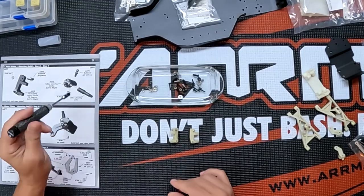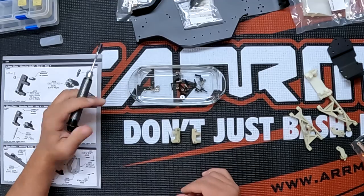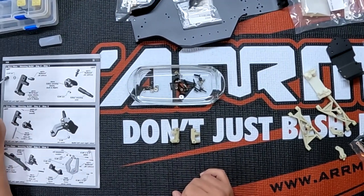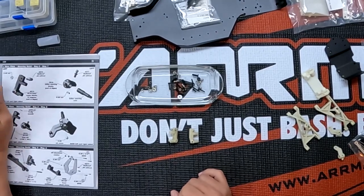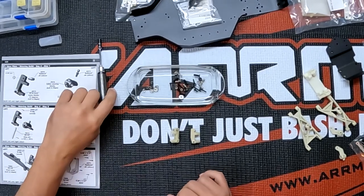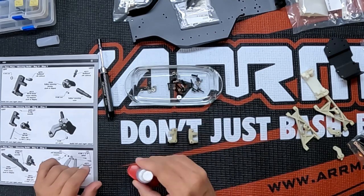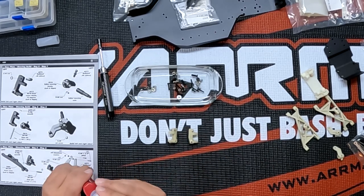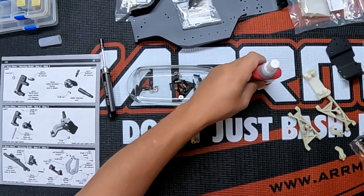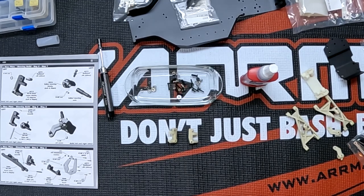And, for example, I was talking about possibly swapping some of this hardware for aluminum lock nuts. Cannot do. These are 440s, and all of the aluminum hardware that I have access to is all metric. So cannot do that, but we will be using blue Loctite. And I wish I had my small bottle, but it is packed away still.